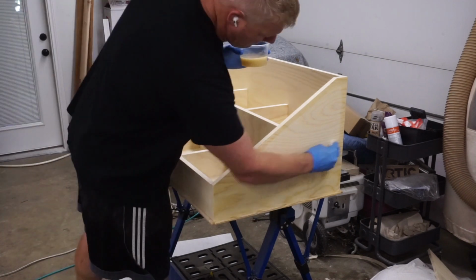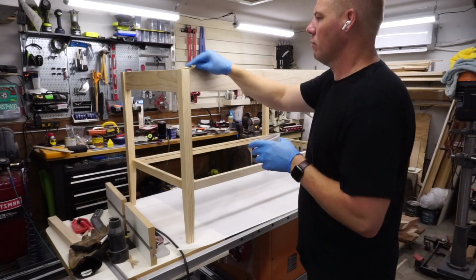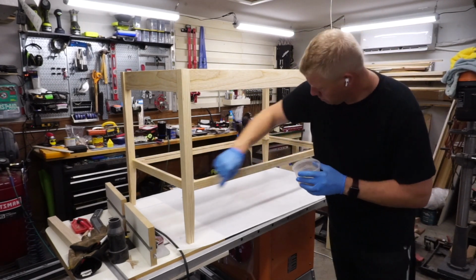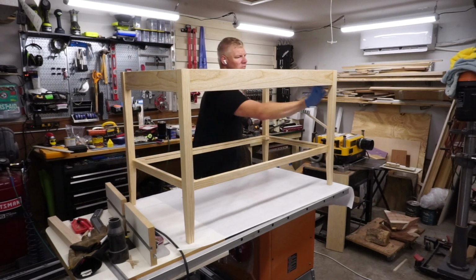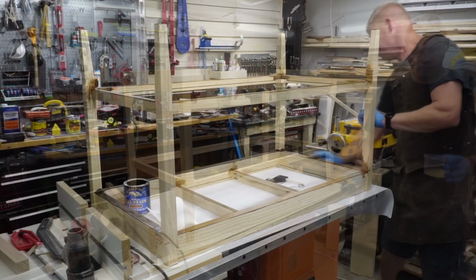I had some concerns about the ash plywood staining evenly, and with the color matching the solid hardwood. I did many tests and determined that it was best for me to seal everything with a very thin cut of shellac. I just used store-bought de-wax shellac, cut it 50-50 with alcohol, and applied it to the entire piece. This helped even out the colors, and although it did not completely prevent blotching in the plywood, it certainly helped.